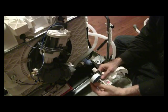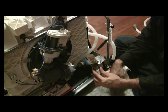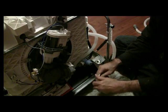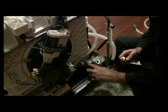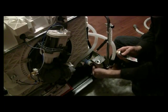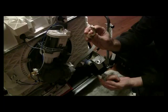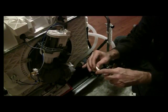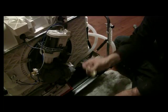To make this work, you're going to need three items. One is Teflon tape — the blue one, for water. Two is pipe joint compound, and you're going to need that. And three, you need a paper towel because this is going to get messy. Some plumbers have done this one way for years, and some differently. I do a combination of both. I'm going to make sure that this joint compound gets all the way inside the fitting, and also on the end of the additional fitting. I do this because I am allergic to water leaks, and I hope you are too.